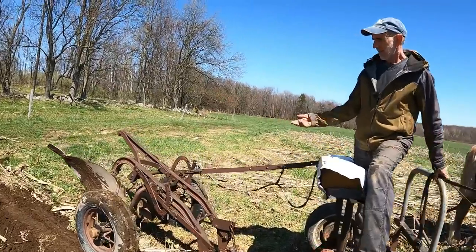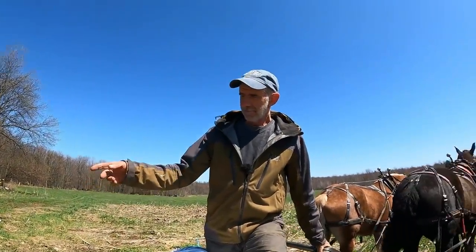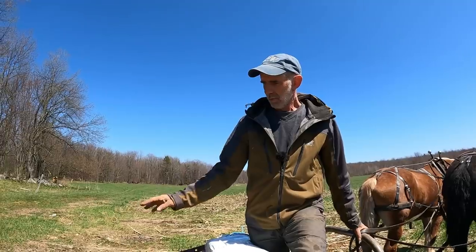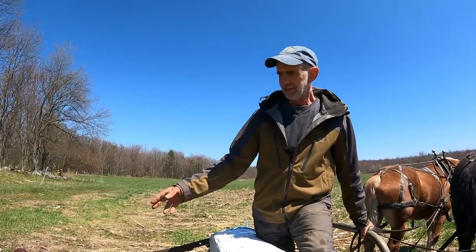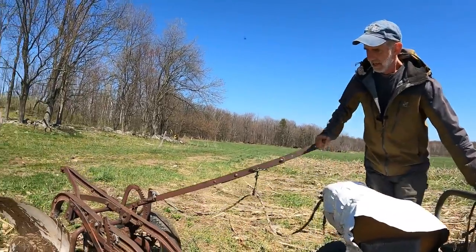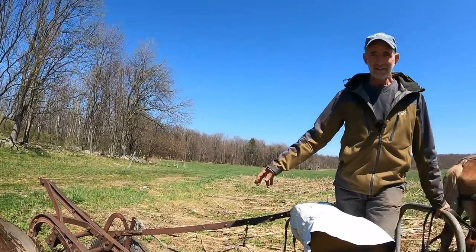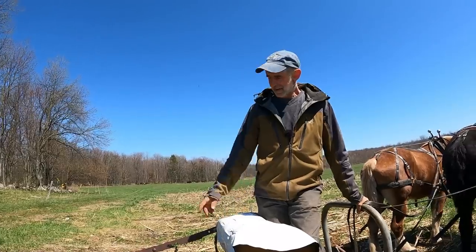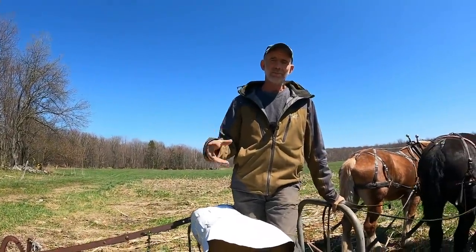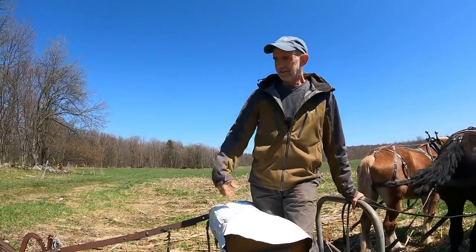These plows are great. I think I told you on my last video, or when we were hitching up, I used to have a wheel on the back of that plow, and that actually helped keep more weight there. One problem with this plow, and as I get going I can adjust it and it won't be so much an issue, is that it's not balanced right. So you'll see this is actually flopped ahead like this. I had pulled it to kick it into gear, and for some reason it didn't. But a lot of times when they sit around for long times, and you mechanical people know what I'm talking about, the dogs inside that wheel get kind of gummed up, and they don't always work properly until they're used a little bit. So I'm going to swing around and get started again, and we'll see what we can do.